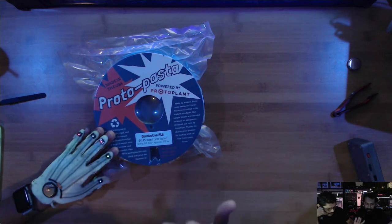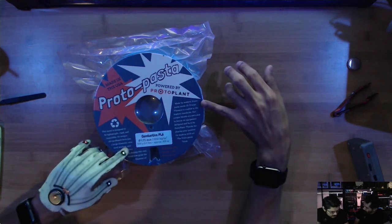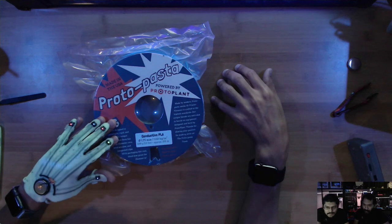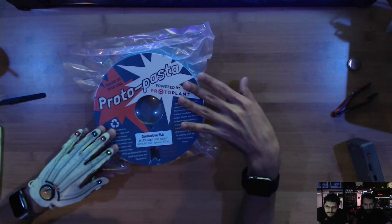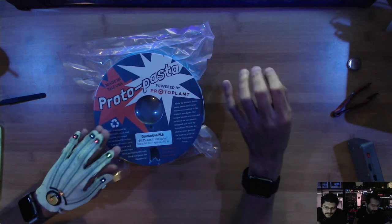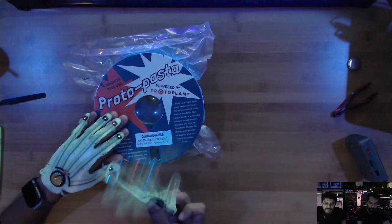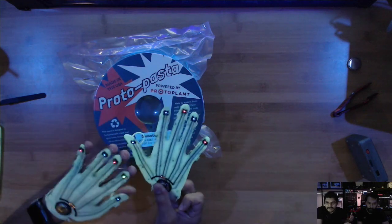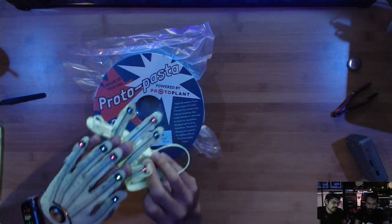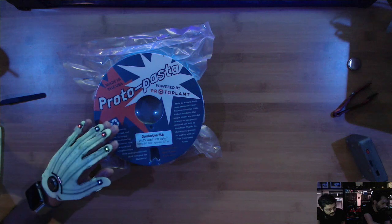Of course, when we test things out, we make projects that you guys can build with them. So everybody wants to know, how conductive is this stuff? This is 1.75, the spool that we're going to have in the shop. It's 500 grams, and since we'll be printing the traces with this, you shouldn't need too much. Noah, what is the conductivity of this? The way they're testing this, folks, is a little bit different. They're using volume resistivity. Since it's 3D printed stuff, it's not flat. Their little test rig uses a 1 by 1 by 1 cube of material, and the resistivity changes depending on the features. If you print a part nice and flat, you get less resistivity. But as soon as you start going up in the Z, if you have something like a trace traveling in the Z, you're going to have a difference of about 85 ohms of resistance, give or take.